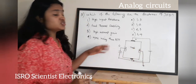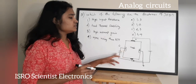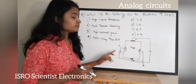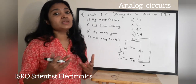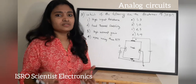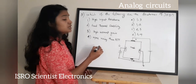This is the general structure of a JFET with an N-channel. The gate-source junction is normally reverse biased. Since the gate is reverse biased, there is no current flow at the gate under initial conditions, and hence the input resistance of the JFET is very high — current is approximately zero, making input resistance very high.